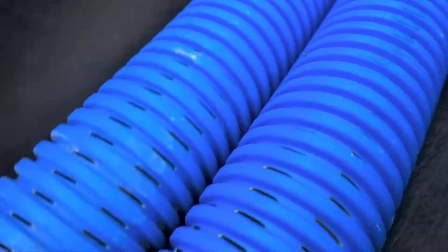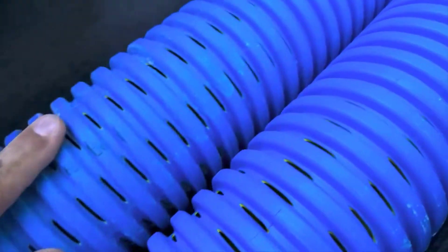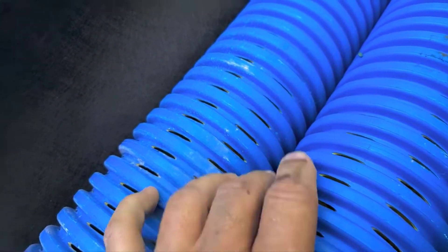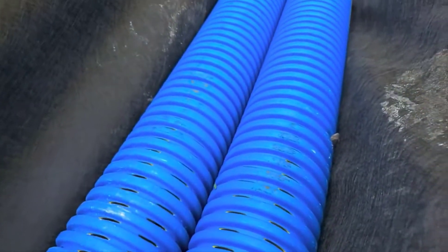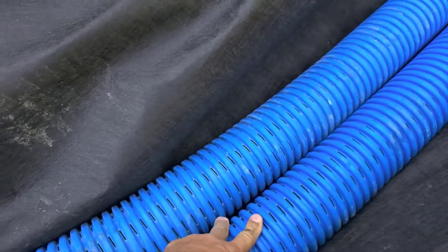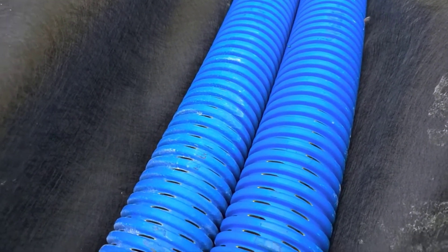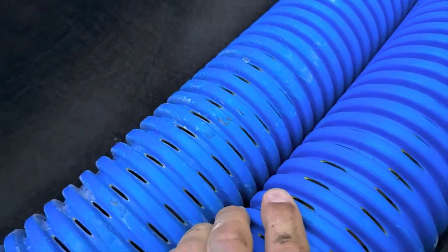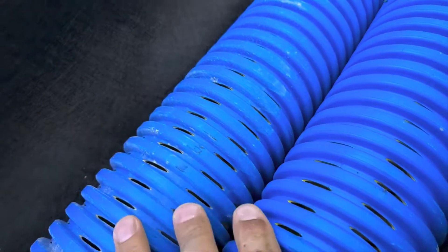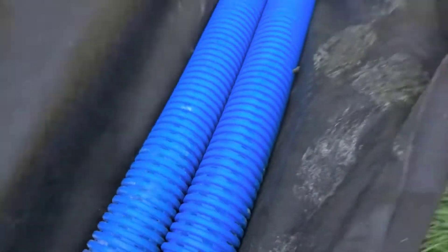It's simple. We wanted these big outlets for two reasons. One, the water goes right into this pipe and this pipe acts as a giant void — just like when we go up in size on aggregate, the larger the aggregate the bigger the voids. If you don't have big aggregate available, say you're stuck using small stone, it's even more important that you put two pipes in, because you create the voids. Two four-inch pipes is a monster void in your system.